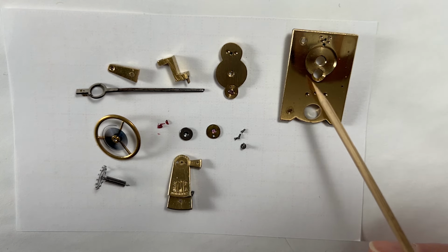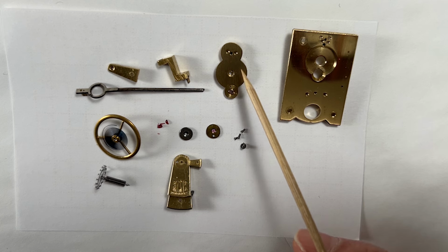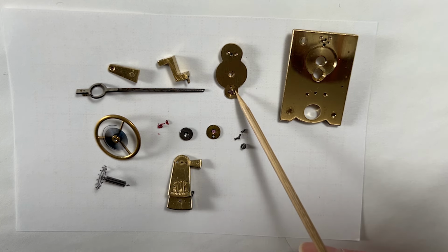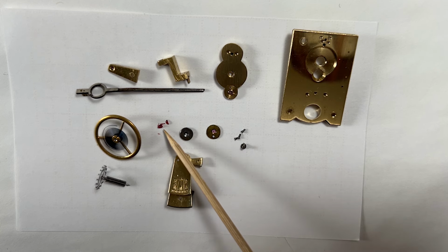Platform escapement has been dismantled and cleaned. The plate that mounts here holds the escape wheel jewels. This balance staff cap jewel mounts in this plate. This steel balance staff cap jewel setting mounts on the balance cock. The cap jewel is broke into multiple pieces.